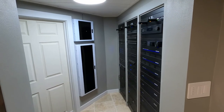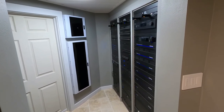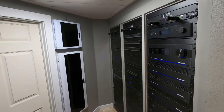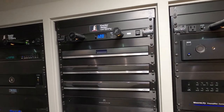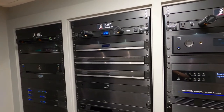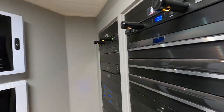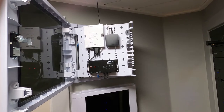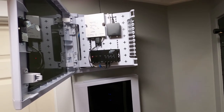Hey, Tyler Theater Design Company. I'm going to go over the lighting control system in our demo room piece by piece to give you an overview of what it takes to do lighting control with multiple zones. As you saw in the previous part of the video, we have a seven-inch touchscreen we're using for an RGB lighting controller. That piece is running off the RTI advanced controller — it's an XP8V. They make various versions: XP6, XP8, even an XP4, so you don't have to go crazy and do a rack mount. That is being controlled two different ways: by the Lutron via telnet, and we're also using serial commands from the advanced controller to tell the RTI to do certain things.